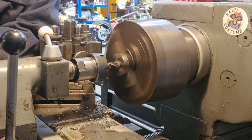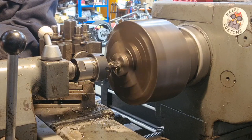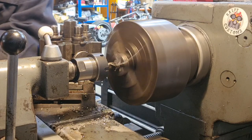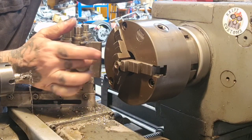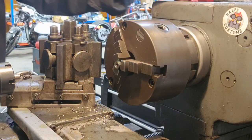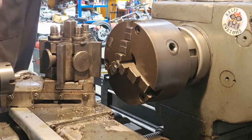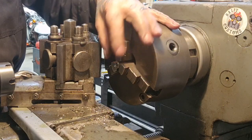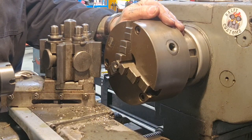I'm just going to gently work that cutter in until we've got less than 2, which has got to be about there. Hold up. No, that's not too bad. That's not too bad at all. That'll definitely take the circlip. And if I do the same on the other half of the part, to take the gauze, then we'll be winning. I'm happy with that, I'll take that. That's the job done. So that's one down, one to go. I'll machine the other one off camera. And then we get on to the second half of the adventure.